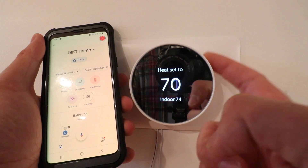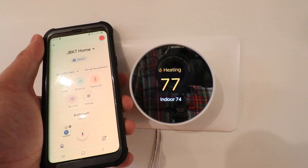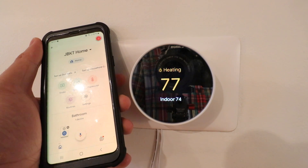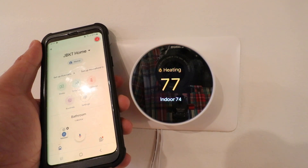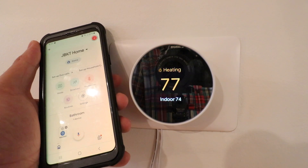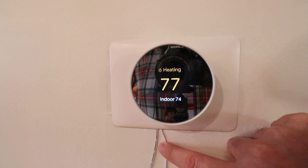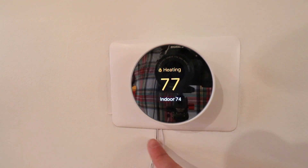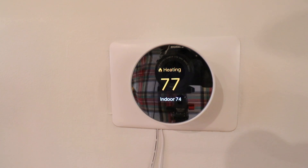Now let's see if our thermostat will work. We can see that heating popped on and I can hear my HVAC system turning on right now. That is how you install a common wire adapter with the new Nest thermostat for two-wire or boiler configurations. I have a heat-only system with forced air and this is working fine — I've had it running for 48 hours without any issues. It's very important you get the common wires in the correct terminals: the white wire needs to go in the R terminal with the R wire, and the wire with the dotted black line needs to go in the common wire terminal on its own. If you switch these wires, you will have issues getting your HVAC system to work.